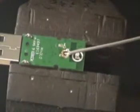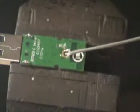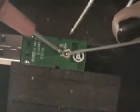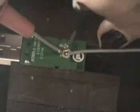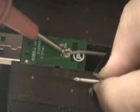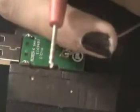Looks like crap, nonetheless. Now we're going to take our multimeter, and we're going to go to the shield, then the signal. All right, let's try it on this side. All right, here's the shield on this end. Signal on this end. All right, no cross, no contact. That's good. Shield to shield, works just fine. I'm going to switch over signal to signal. Get a good connect this time.